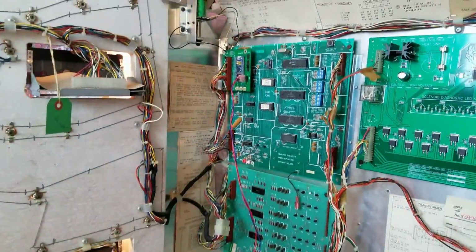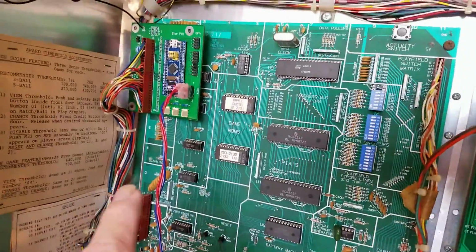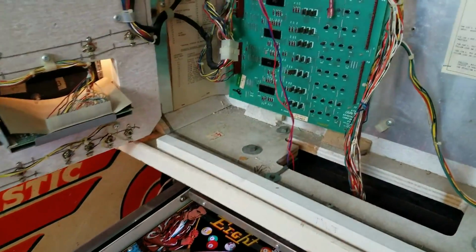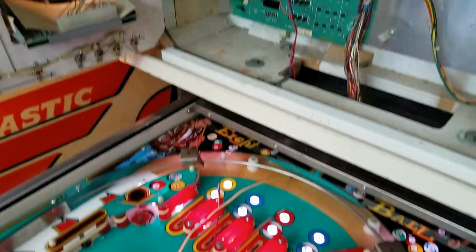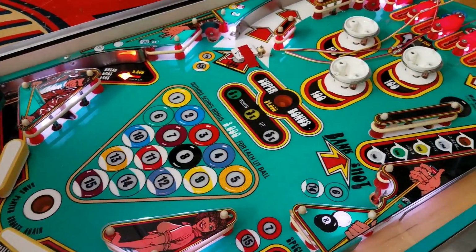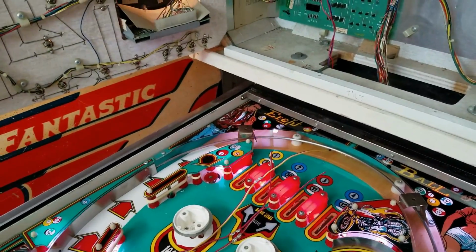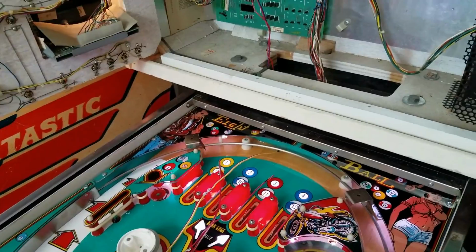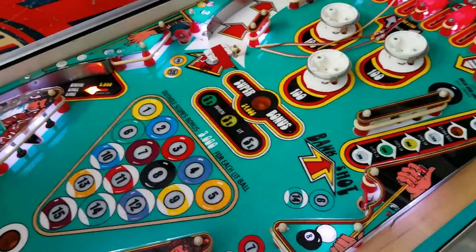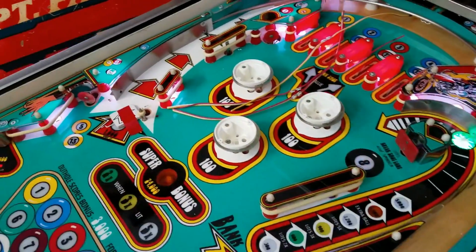Just for the audience, this board will provide power down this row of lights, but that is not hooked up right now. So right now, all the LEDs are powered from the back end of the string up, and as that runs through there, that voltage drops. This is common with these LED strings. If you ever watch anybody's videos on them, they'll tell you all about the fact that you need multiple injections of power into these systems. With just roughly 100 LEDs to deal with, just injecting at each end is probably going to be adequate. But if it isn't, we can always find a spot in the middle and inject 5 volts there too. But for this testing, we can deal with a little bit of dimming.